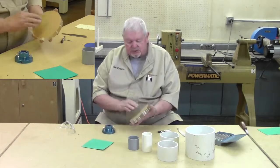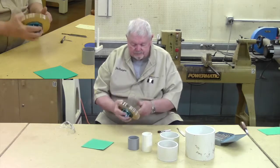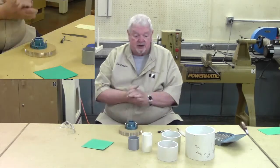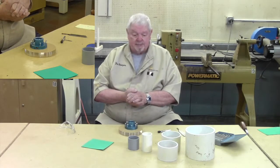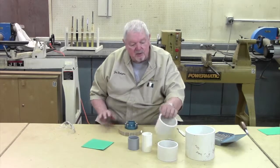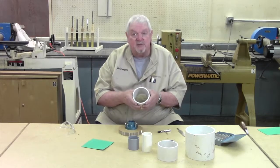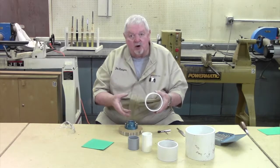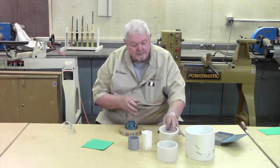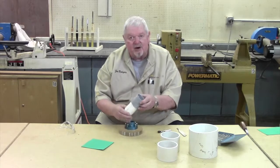I screw the acrylic onto the faceplate on the side that still has the paper backing, because the paper acts like a small seal. For the chuck body material, I've chosen some type of schedule 40 pipe. As the diameter increases, the wall thickness also tends to increase — the nominal wall thickness for schedule 40 is 3/8ths. Schedule of pipe actually comes from the metal industry and refers to how much pressure it can support, so as the pipe gets bigger it takes a bigger wall. I can connect these pieces and create all sorts of different configurations.